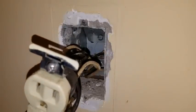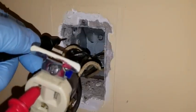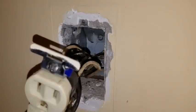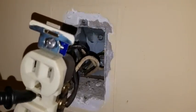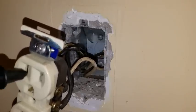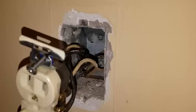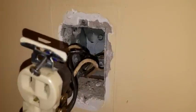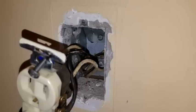Back in the day there was a small gauge ground on these things. You run from the hot to the box and see if we have power — maybe continuity in this case. We shouldn't, it should be off. Let's get this taken apart. I'm going to unscrew this and we're going to see if this is the inlet one, so we'll disconnect the two hots and the neutrals and turn the power back on. If one of these has hot on it, it's the first lead in the branch — the upstream. Let me pull this apart, put some wire nuts on there.